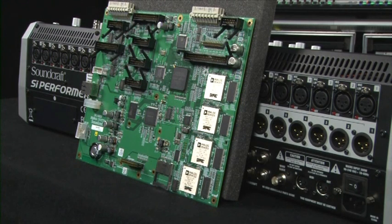At the heart of the SI Performer is the Encoder processor, offering 80 simultaneous channels to mix, mixing to 35 buses over 25 independent mixes, 40-bit floating point architecture, quad stereo Lexicon processors with dedicated buses and returns, dynamics, parametric EQ and graphic EQ on all the buses all of the time.